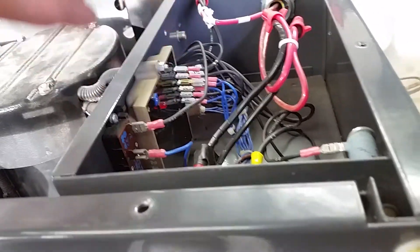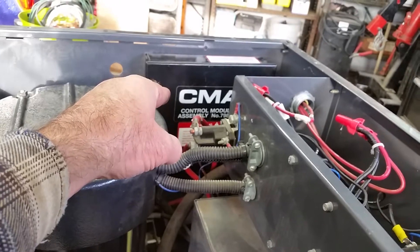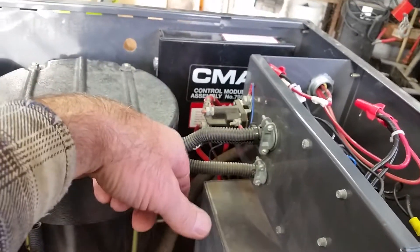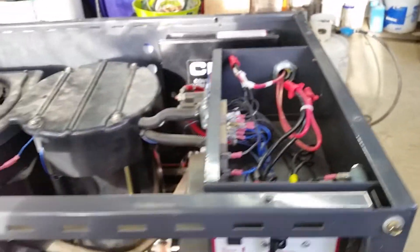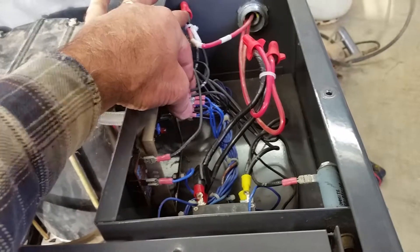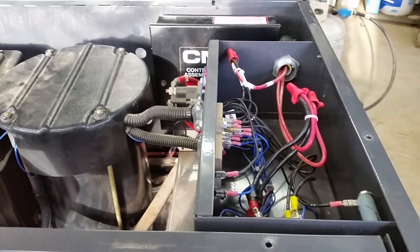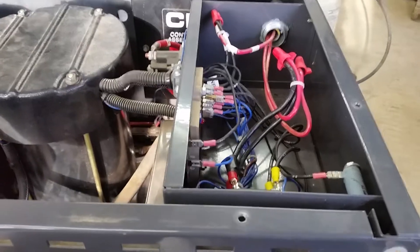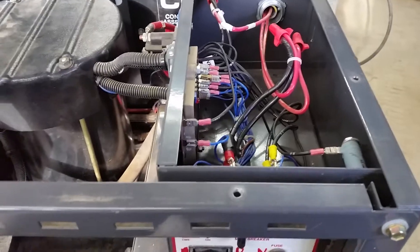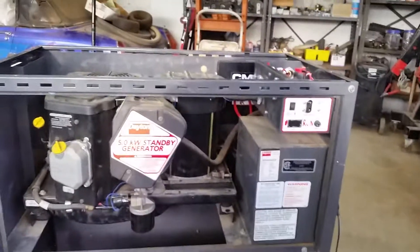This works like a self-latching relay, and the power comes in through the brushes through this little circuit breaker. This connection here — the interface to the circuit board — was suspect. So besides adjusting the voltage, I also tightened up the Stacon connectors and pulled the brushes out and pushed them in a few times to make sure they were free and not sticking. Those were the two things I changed. Could that have been why it wasn't producing power consistently? That's possible, but I really think it was just because the volts were way too low. Anyway, I hope this helps somebody. Have a very blessed day.